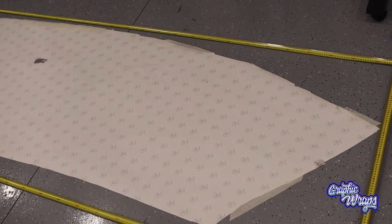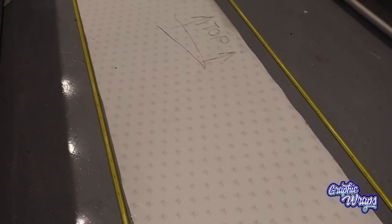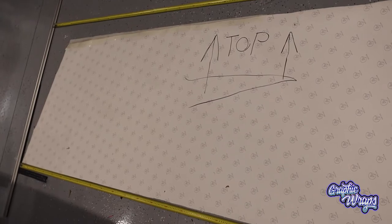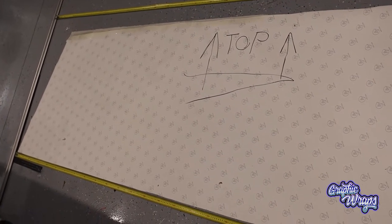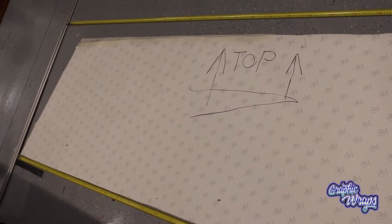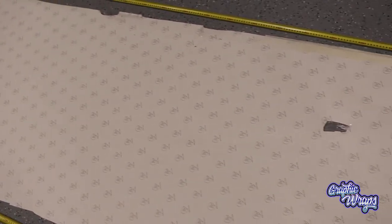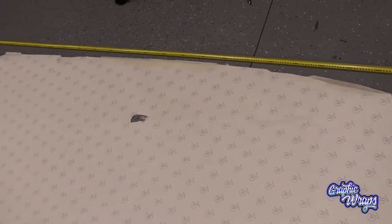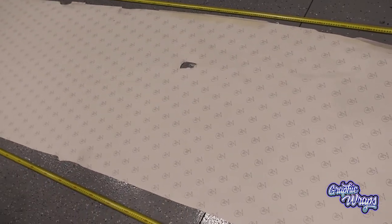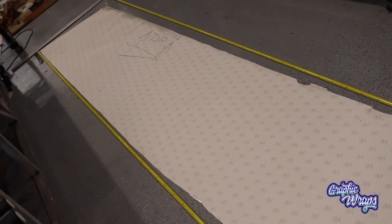Compared to a lot of boats, this is a very square boat — there's not a lot of shape, so the curves don't swing out too much. As you can see, even the very back corner is about 125mm lower than at the peak of the bow. If you've just measured off the side of your boat with a flat tape and tried to sit a graphic to that, you're automatically 100 millimeters out already.